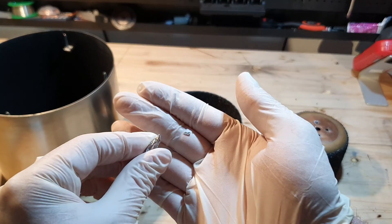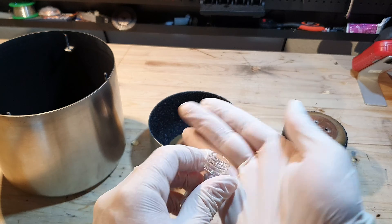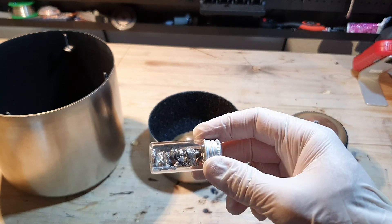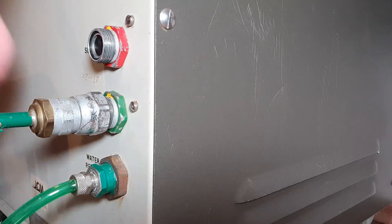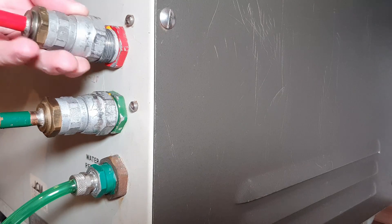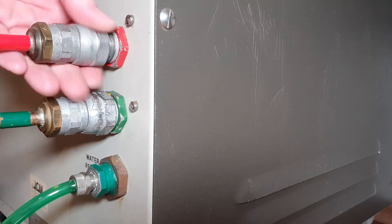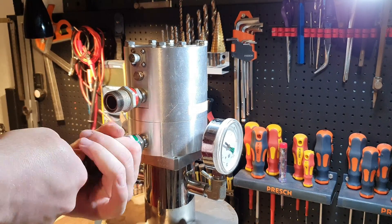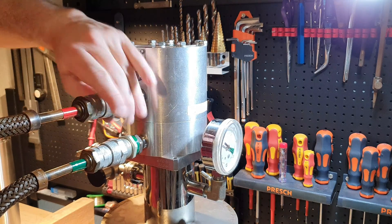As you can see I'm wearing gloves when handling the insides of the pump to prevent contamination by oils from my skin. So it was time to connect the helium lines and test the pump. The red hose is for the high pressure helium and the green hose is for the low pressure helium. I'm waiting for you to crucify me in the comments for not using a proper wrench when tightening the connections. The other end of the hose gets connected to the cold head. On the right side you can see the temperature gauge that goes down to 14 Kelvin. On the left side you can see KF flanges to connect the roughing pump and vacuum gauges.